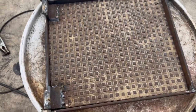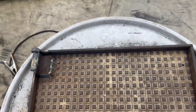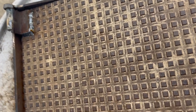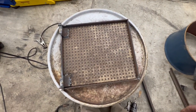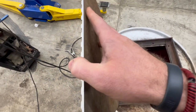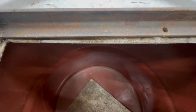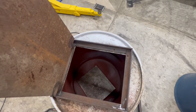My camera went off while we were videoing, but I got the door all welded up. I just made my own hinges from cutoffs of that piece I was showing y'all — the frame we made — and the door swings pretty nice. Now I'm going to make a latch. I'm thinking I'll weld this edge, clamping it so it pulls up tight and welding on the inside, as long as my weld doesn't hang over the door frame.